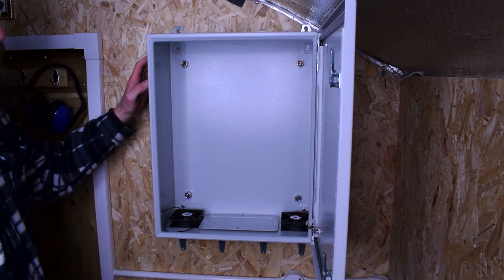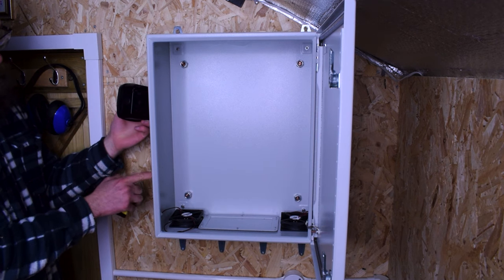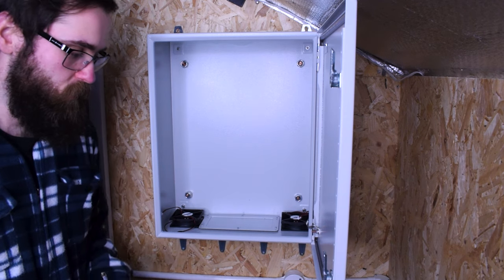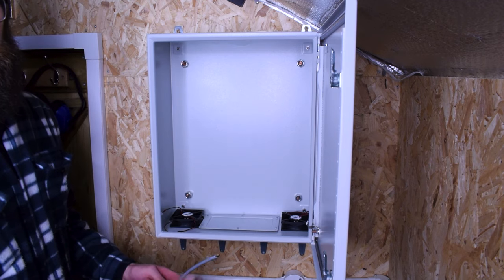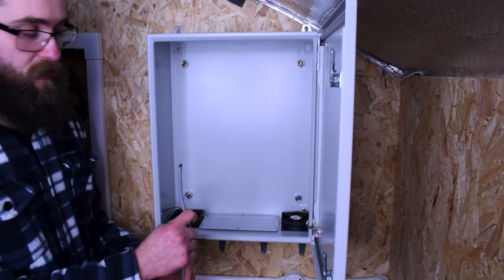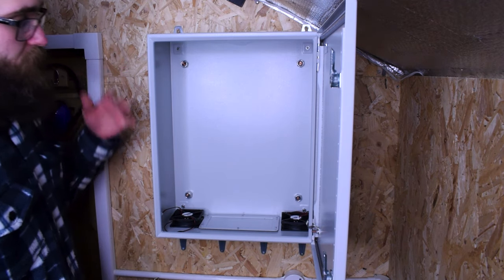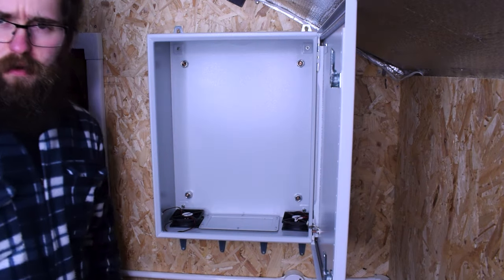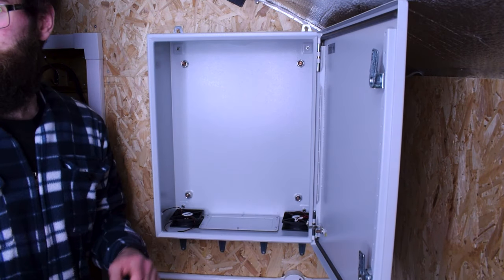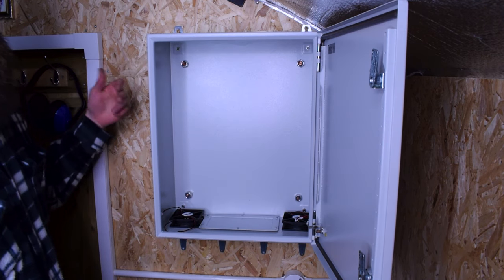On the side, I'm going to have to drill some holes. I'll have my switches here — my emergency stop and my toggle selector. There's some holes to drill so wiring can come in and out. I've also done the wiring from my consumer unit which is down below. I've installed another 13 amp fuse in there so all this runs on its own breaker. I've decided to use shielded coming in from the mains as well, and all the routing and cabling between the different power supplies and breakers will be shielded. What I'll do now is just get that in there — I'm not going to bolt it down, but I just want to make sure it'll sit in there nicely.